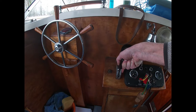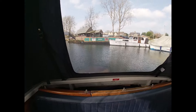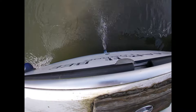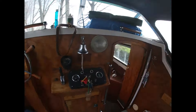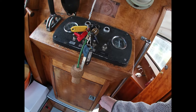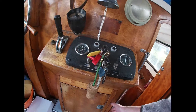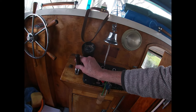Bingo! You beauty! Now just checking that the impeller is drawing the fresh water through the engine as it should — just checking the outlet. And all is good. She lives! She runs! You'll notice when we looked out at the back that there was a bit of silt kicked up behind us. That's because even in neutral when she is revved, the prop does turn a little bit, so it's always going to stir up any sediment underneath if we're in shallow water.